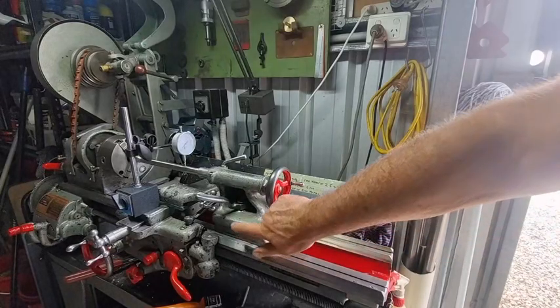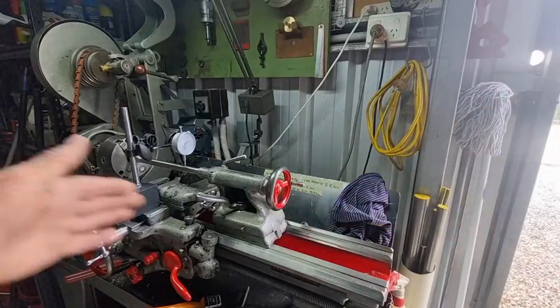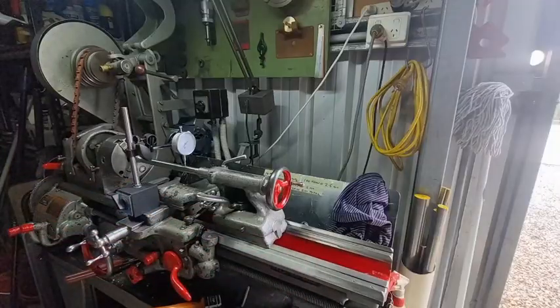It's just a matter of adjusting these side screws on the tailstock, going backwards and forwards on the center line of the shaft, adjusting them until you get virtually no movement on the needle — and that's what I did. The wear on the bed — honestly, for something that's 72 years old, 2.7 thou from one end to the other, I don't think that's critical, especially for the work I'm doing. I'd be interested in hearing from others what sort of wear they get end to end — we're probably measuring in the middle of the lathe, but it gives a good indication.